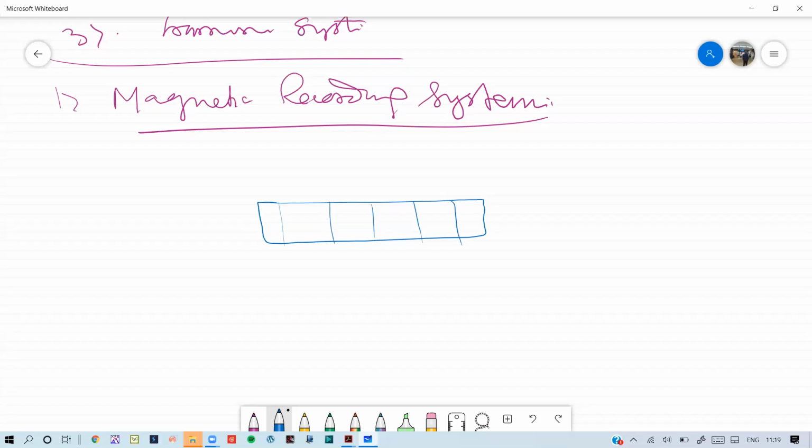These are different magnets, and it has been made and is available in the market, with a thickness of 14 nanometers. Remember that those different layers, the ferromagnetic layer and the metallic layer, have thicknesses of the order of nanometers. It has a direction in this, and here it has this direction. These are the directions of those magnetic moments, or the magnetic domains in that magnetic read head. You have a sensor here, a GMR read sensor.